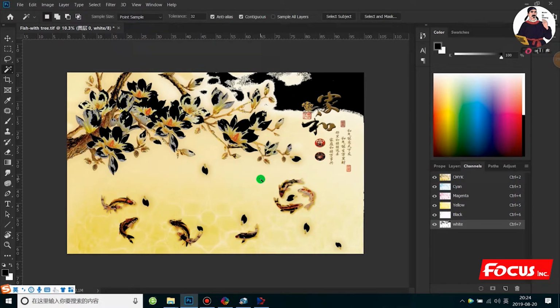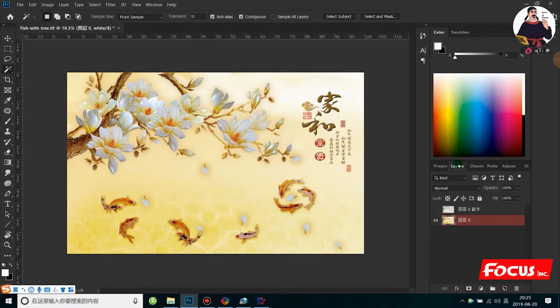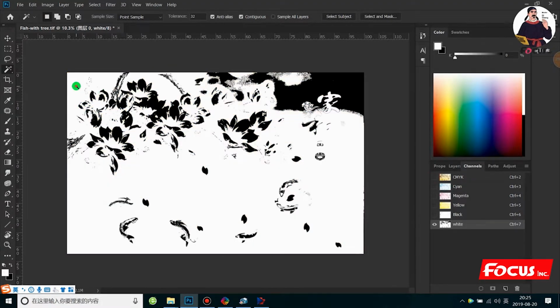And also we want to print the same area with varnish on top of the color. So we can also, in the same way, select the area we want. For example, we want to print the same position. And also one more thing, if you want to print here, just the dark area has white ink. But because we want to print on darker materials, we also need to create another area to fill with less ink.